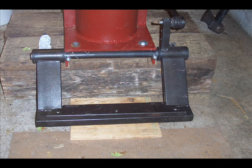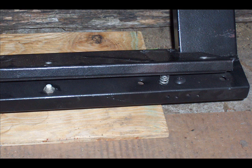The next piece is the foot pedal. At the top lever where the linkage attaches I actually made three mounting holes, which allows us to adjust just how much leverage you have when you depress the pedal — how much leverage you have when lifting the motor. That adjustment, along with the adjustment of the rod itself, allowed me to put the pedal as close to the floor as I wanted so it's more ergonomical to run. The other thing is the two-stage part of the pedal: a regular set of hinges and a secondary pedal with a set of springs and a momentary switch. So once you flip the main power on, the motor can remain off until you step on the pedal just enough for the electric motor to come on, and then hard enough to actually engage it and start hammering.